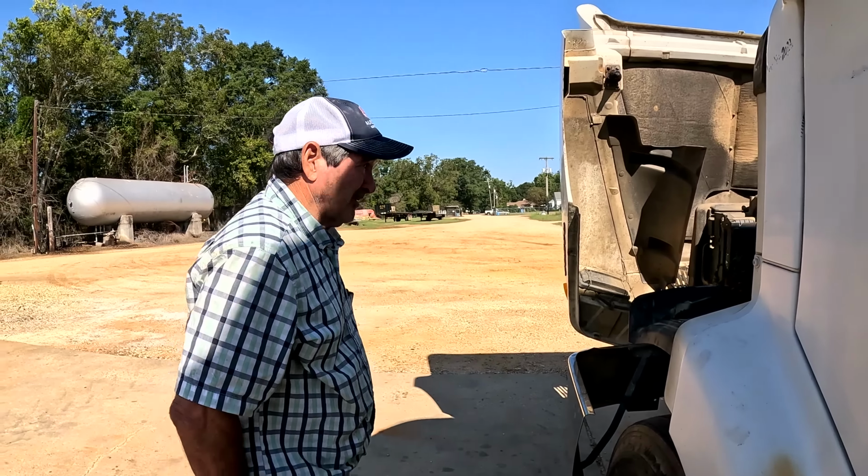So anyway, when we went back up there Friday, we took this whole pre-sieve out. It's got two bolts holding it. I think it's one right there, and it's like one over there. But it's only two bolts that hold this thing in, and then all you have to do is we actually hooked a strap around it and pulled it backwards, and this whole pan right here, sieve, just slides right out the back on those little rails. It never hits the upper sieves. It just slides right out the back.